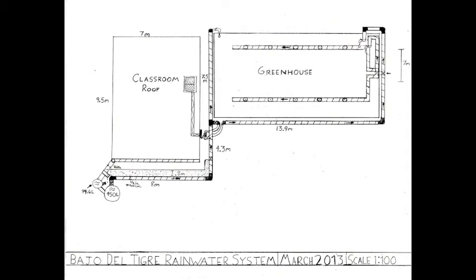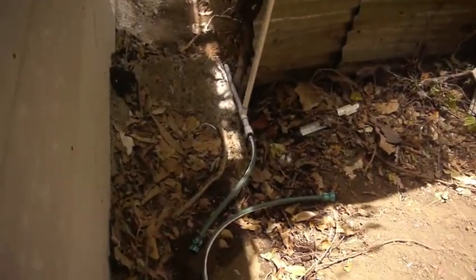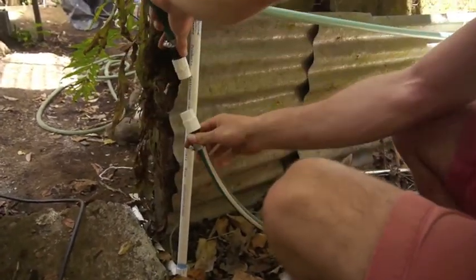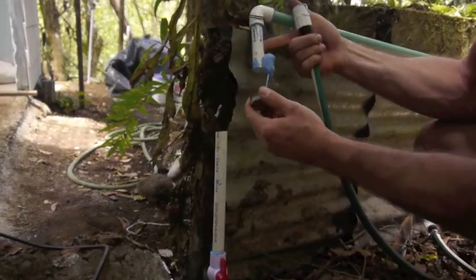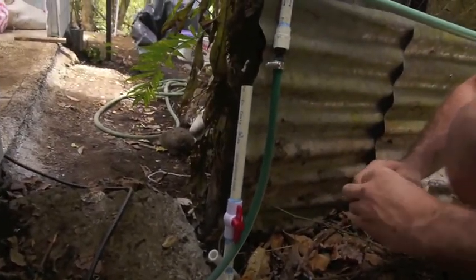We will now get into the pump system, which will be connected along the side between the classroom and greenhouse. We have already installed a preliminary hose that will be attached to be used with the pump. The pump will only be used for irrigation and the greenhouse sink. First, we need to attach the shutoff valve to ensure that the sink between the greenhouse and classroom is not using a pump. We will then attach two separate hoses to flow the water through the pump, then into the sprinkler system as well as the other sink. A pump like this is not common for a rainwater system, but we need to increase the pressure to reach the sprinkler system and the other sink. Later, we will connect the pump onto the wall and then connect the hoses.